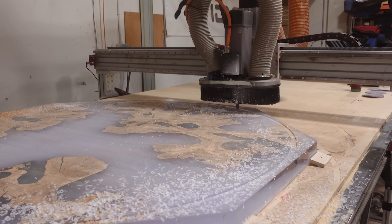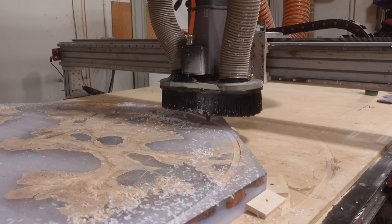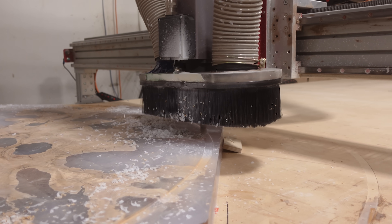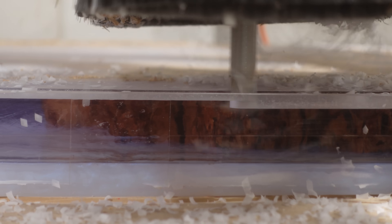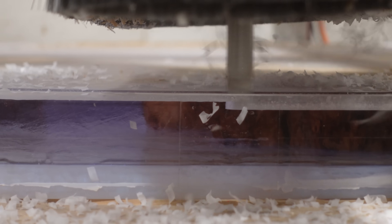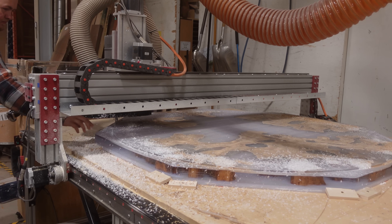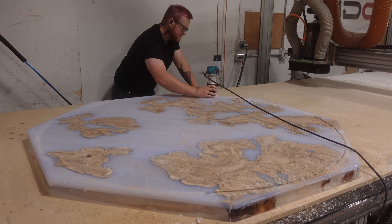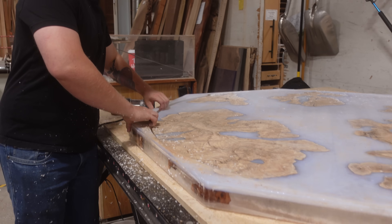The only reason we did the mold octagonal was just to save on the volume of resin — and as you can see, by cutting off those corners we saved quite a bit of money. An important thing to note for this cut is that we're going less than a quarter of an inch per pass, so multiple passes are required to cut a table this thick. This is the only way to ensure a clean cut where the resin doesn't chip out and we don't risk breaking the bit and taking a chunk out of the edge. Once we've got most of the way down we can flip the piece over and use a flush trim bit on a hand router to get that excess skin trimmed off.